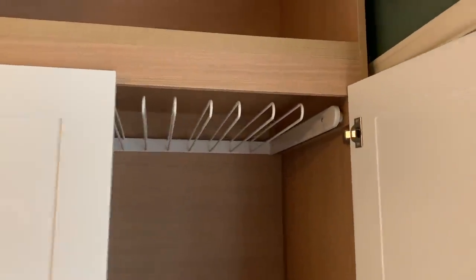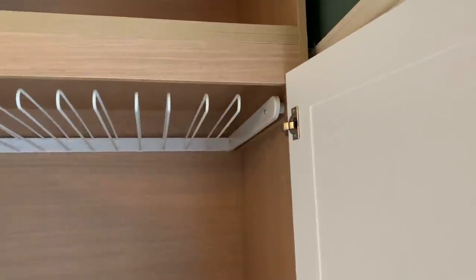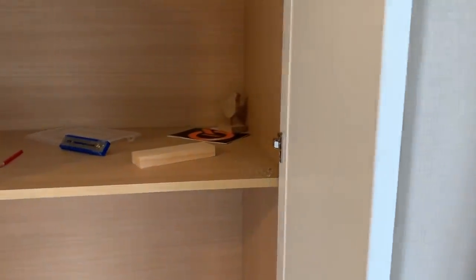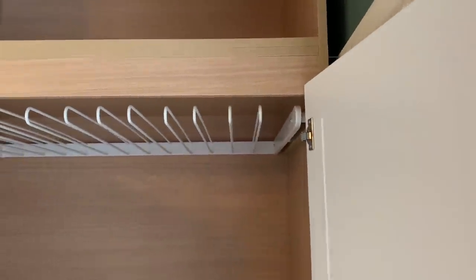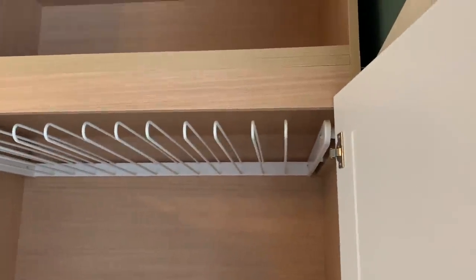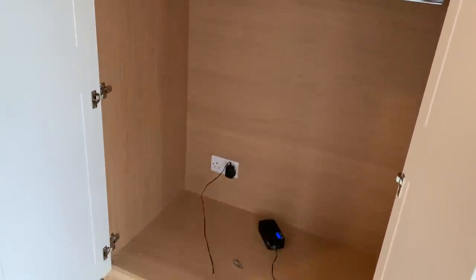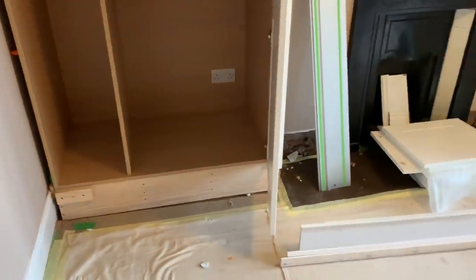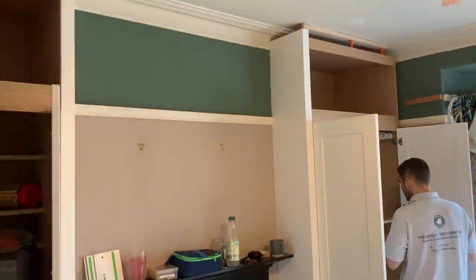Another issue was the pull-out: I designed it knowing it would fit with those spacers, but not knowing it came with some additional spacers. When we started putting the wardrobes up I suddenly thought this rack might hit the door before it comes out — because these doors on inset hinges are thrown into the unit. As luck would have it, it does have those spacers. I think to be successful you have to have that mixture of bespoke design, which makes you distinctive, mixed with enough standardization that you can produce things efficiently — it's a constant tension.